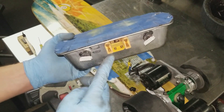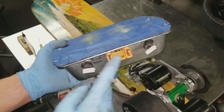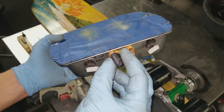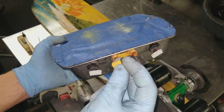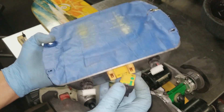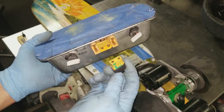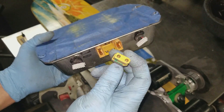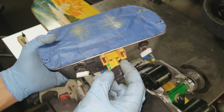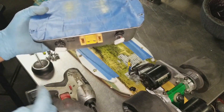With all this power and running batteries in series, the initial connection creates a huge voltage spike that can damage your VESCs. So I have what's called an anti-spark connector. Inside I soldered a piece of copper wire from one end to the other — specifically Romex cable wire — cutting a small section and soldering it in. This puts a resistor in the first half, so when you connect it the resistor absorbs the spike and heats up instead of inducing a spark, protecting your VESCs on that initial power-up.